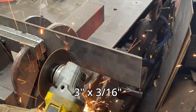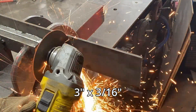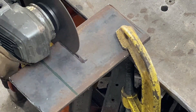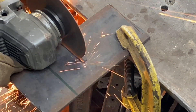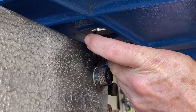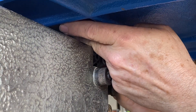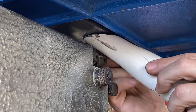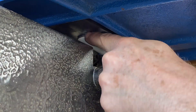This is 75 millimeter by 5 millimeter flat bar. I need to cut a slot in here for the blade to fit through as well. The plate will go in there, and then the pipe will come up and sit onto the plate, and then I can weld it around the edge.